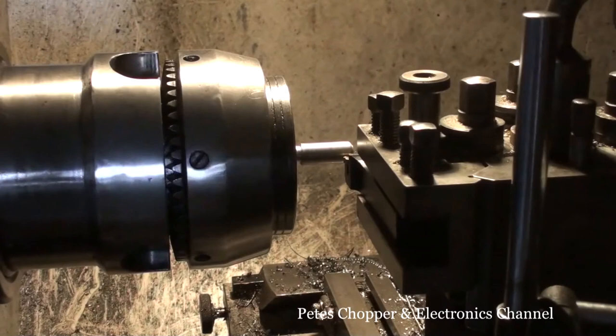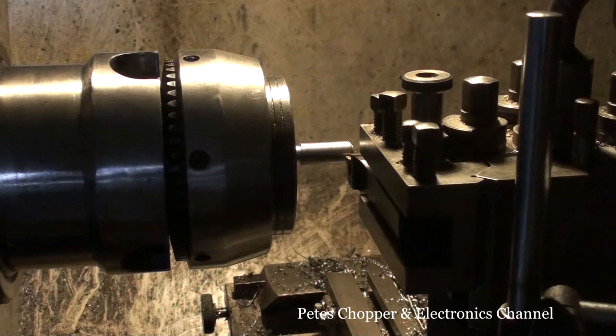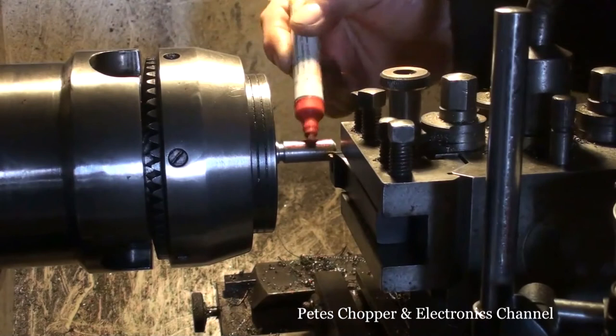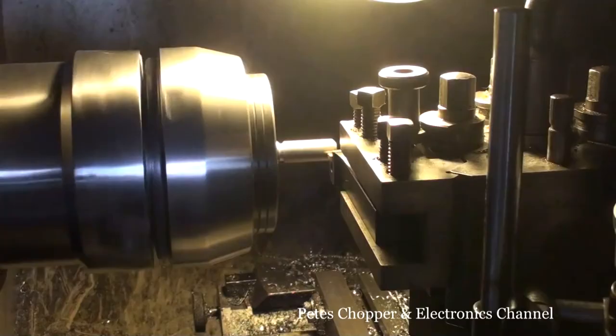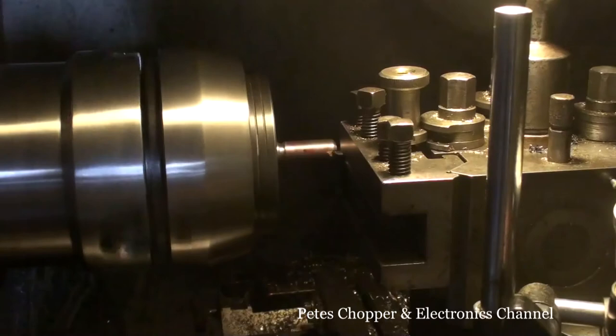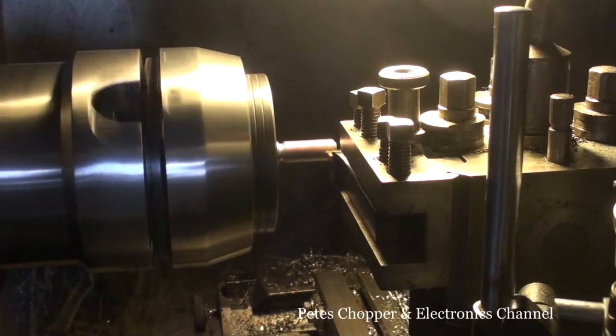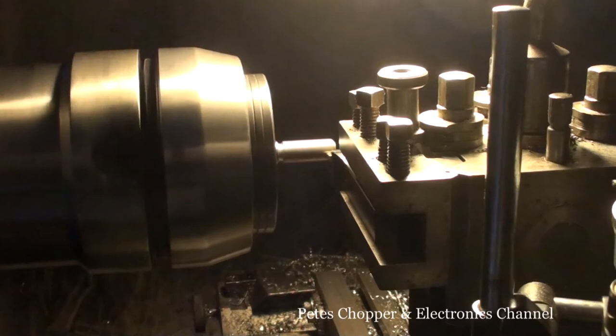Okay, first things first. First I want to set zero for the feed in dial gauge. And then I want to check that I've got the right gears and I've got the right pitch. So I'll pop a bit of red marker dye on this one, see what's going on. And we're just touching there, and the dial is basically virtually on zero. In fact, I'll go with to say there, that's zero. So we'll start from that point. And see the gauge. And I'll do a cut.